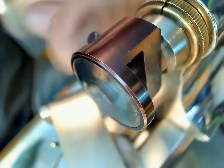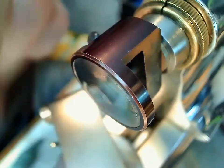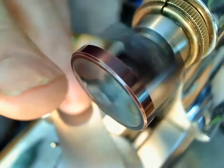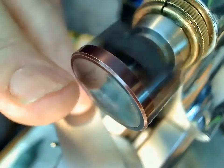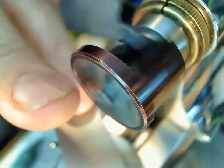The other side of the J-cot tool does have these little holes where you can stick the pivot through and do what you're doing here. But again, you've got a lot of control with the variable foot pedal here, and so I can make sure the speed is right. You don't want to spin it like this, because then your pivot will be gone in 5 seconds.